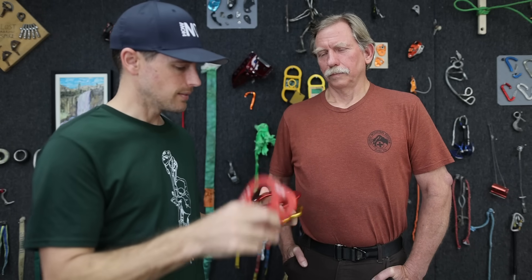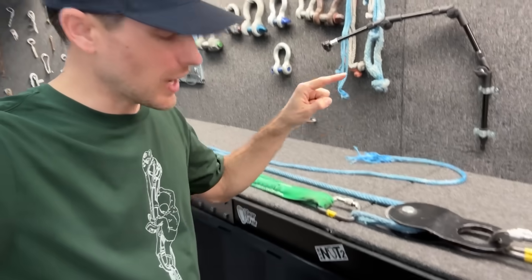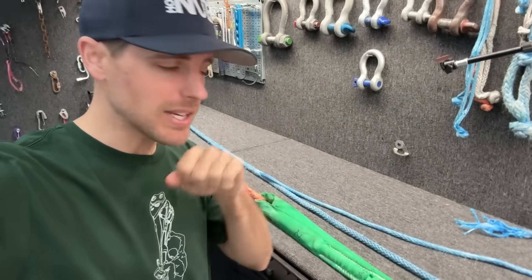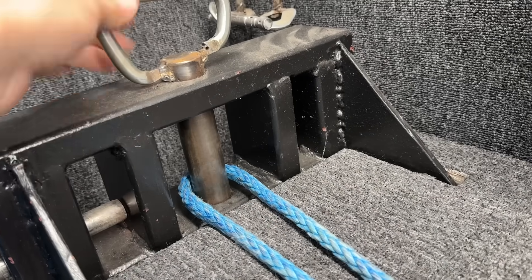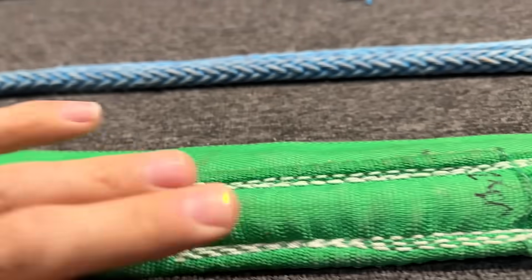So what shall we break today for this topic? We want to test the master point concept — how strong is it? Pull out the big piston. I think sometimes we get surprised at what it looks like when we start pulling big forces on a master point system with two connections of everything on a piece of aluminum. Pulling strong stuff is tricky. We've got a big fat pulley here that's going to be our two-to-one, because my hydraulic only goes up to 70 kilonewtons. So we start here — this side goes through to the pulley and gets pulled with a hydraulic ram underneath, redirected by some arborist pulleys.